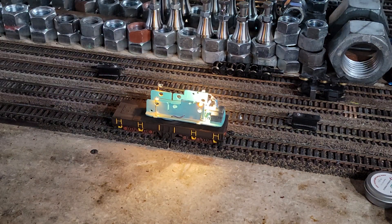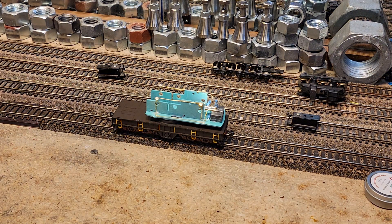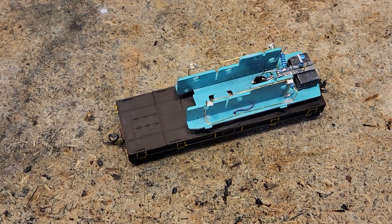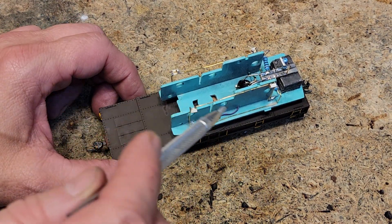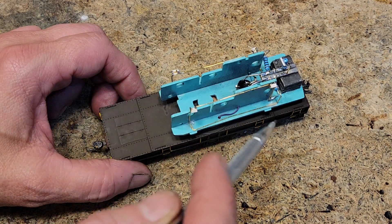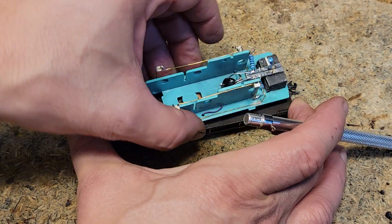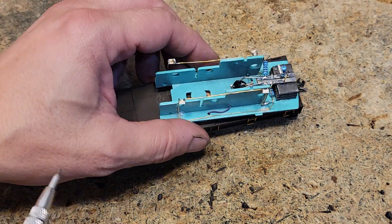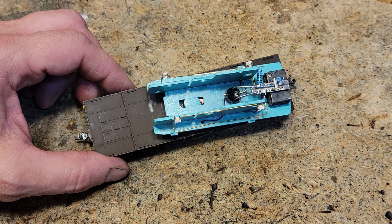It's actually really good. Let's turn on some lights here and get it close up. Let's get a close-up of what we got so you can see. Remember underneath we've got that plate — the copper circle — and we've got a cutout going diagonally so that when we turn it, it goes off. And if we turn around, it's auto reversing polarity, which is what you need in DC. But even still we've got the bridge rectifier here.